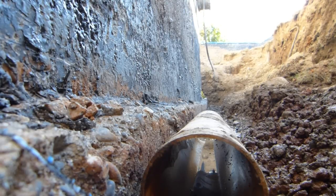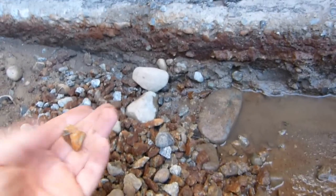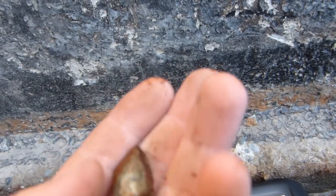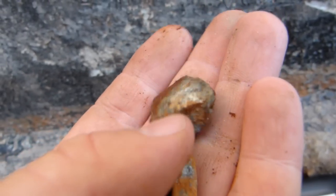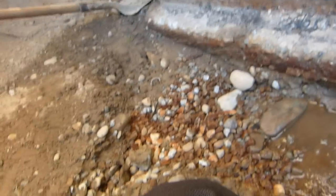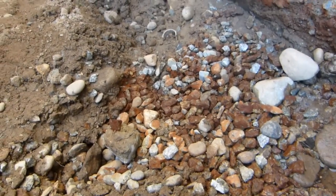Also around it, there should be drain rock, not dirt. Here you can see dirt for the side wall of this trench — there should be drain rock: clean, crushed drain rock, crushed with sharp edges and angles so it doesn't compact. Round washed rock or gravel taken out of the river with rounded corners and edges compacts more than this angular stuff. Plus the angular stuff is cheaper, though that might change depending on where you live or how close you live to resources.